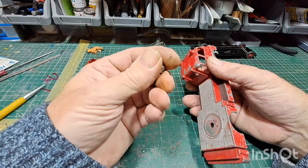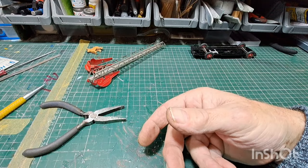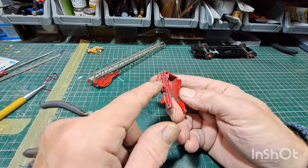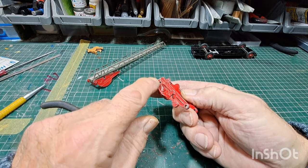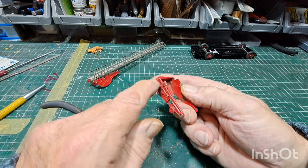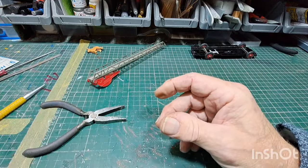There's a little pin there — that's your bell off. Now we've got the spring out of here — the spring that sits in there. I had to file it and file it and file it because it's very very close to there, not a lot of room. You don't want to do it with your multi-tool because you'll damage some of the features around there. Then pulled it out — so we've got that spring out now. Needed that out really to clean it. So that's that one done.